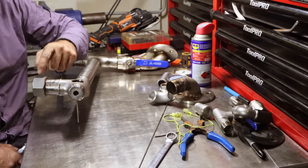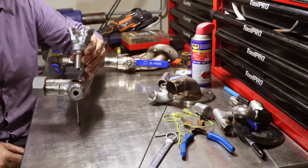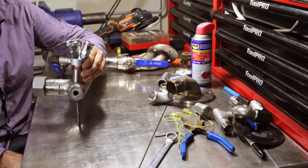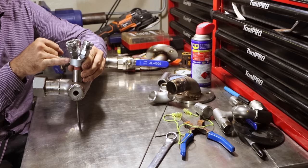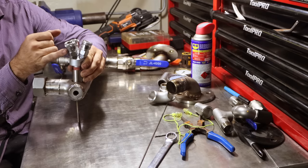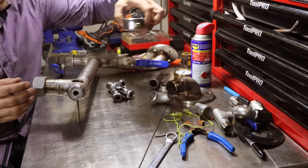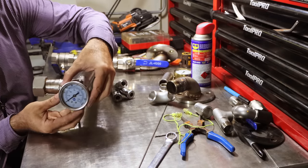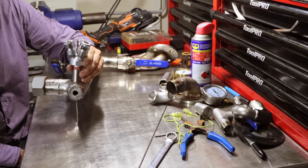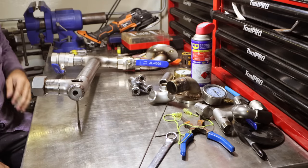The big manifold — this is where the starter motor feed goes to. This is where the regulator used to be. I've drilled a big hole in the bottom of it and I'm going to weld this in here. This is half inch Nitto fittings for a half inch line for our unregulated feed. If I need to, I can also increase these to a bigger size, like a single three quarter inch, if I find that these aren't doing enough. I'll get a gauge on this here that comes out the back so we'll be able to see what's going on when we're starting the engine.